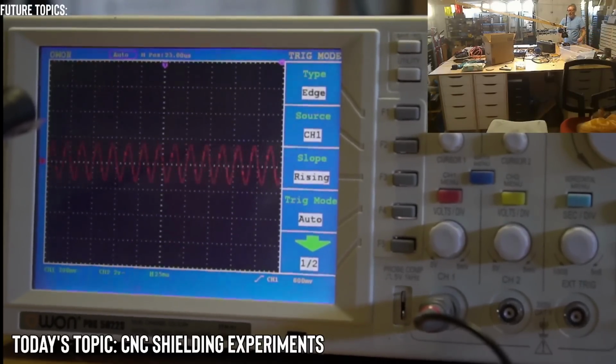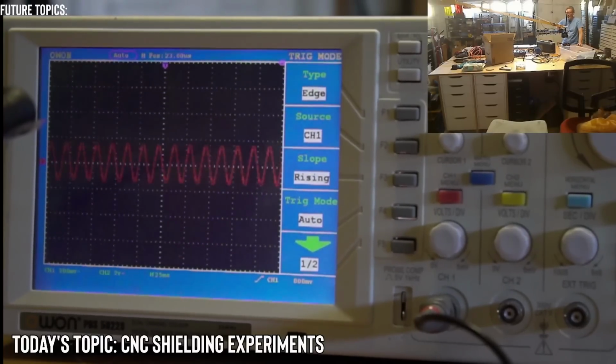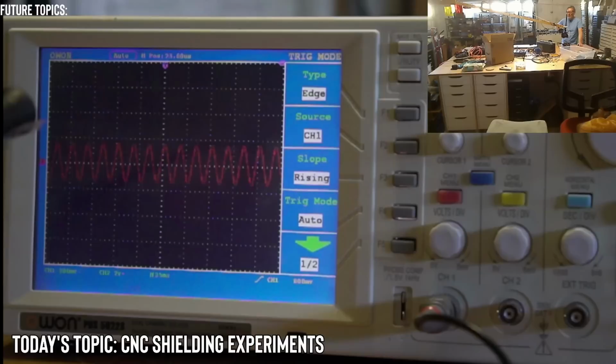So this will be the cliffhanger for next time. I have to go to the doctor's for a general appointment, so we will stop it there. I guess we could ponder until Tuesday what's going on with the capacitor and what kind of tests we can do, because I want to take the capacitor off because I'm still looking for the worst case scenarios. This is one solution, but I also want to test this solution in circuit so we make sure that we still get a good signal between 0 and 24 volts when we trigger a limit.